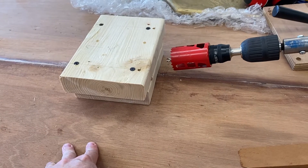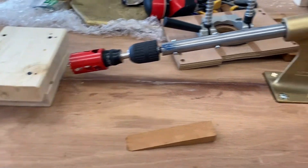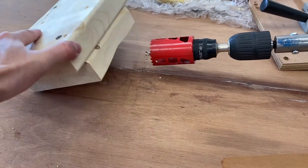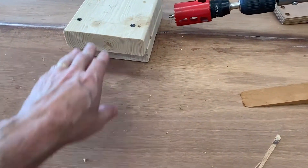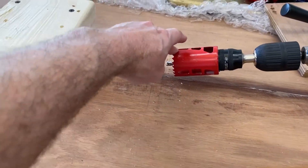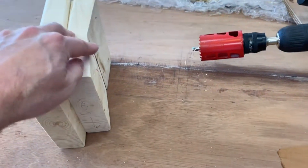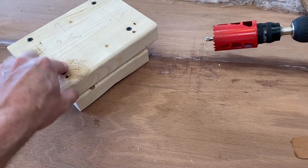I'm working on the starter block for the hole saw for the prop shaft. I'll bolt this down temporarily where it goes. This block is just two 2x6 pieces of nice soft pine, and the grain is going sideways because end grain is harder to drill into. I saw where this contacts the hull and positioned this a little further back — half inch or so — and cut angles on that to match, then screwed this piece on here.